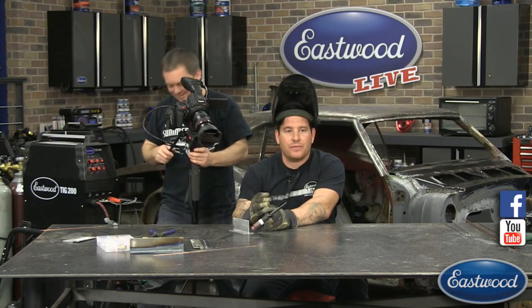Okay, so somebody asked a great question we get from time to time. What is better, TIG or MIG on sheet metal? It depends on your skill level, to be completely honest. If you're comfortable with MIG, definitely use it, but TIG welding overall is better. It's a softer weld. You can actually hammer and planish the weld, whereas a MIG weld tends to get brittle and will crack when you hammer on it or want to move the metal around.